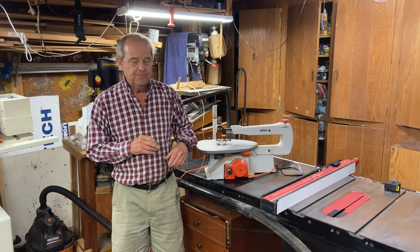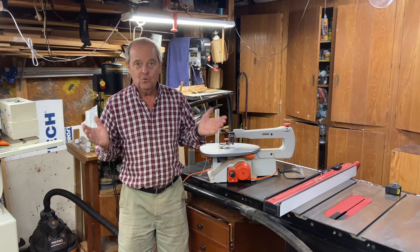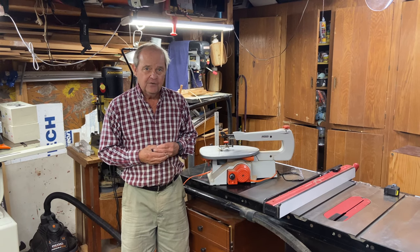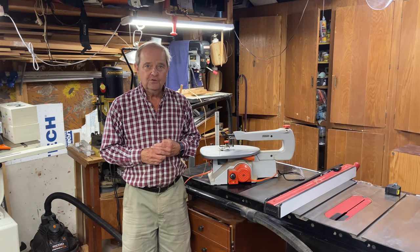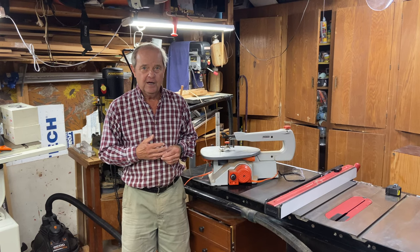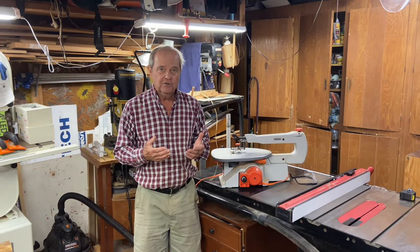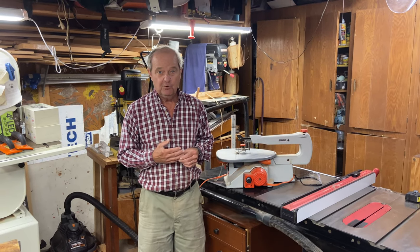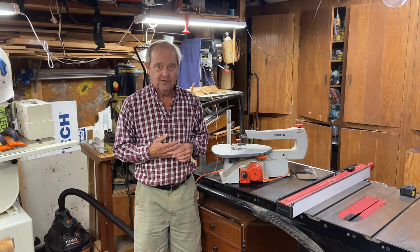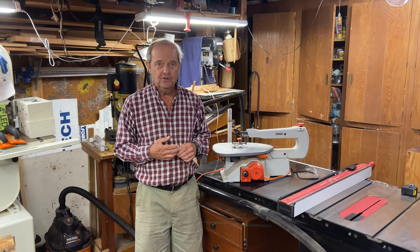It's interesting that you have this variability. The question is, why do you have that variability and why do you want it? For one thing, you don't want the blade to get too hot. If you're going through thick material and going up and down at a high rate of speed, the blade's going to get very hot. It could in fact cause the metal to separate in the blade, or more likely burn the edges of the cut. So the thicker the wood, the slower the speed you would want to use.